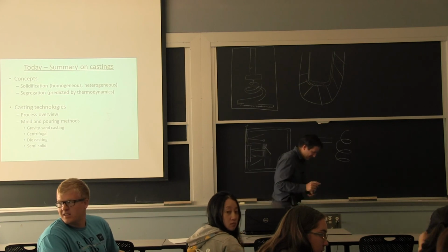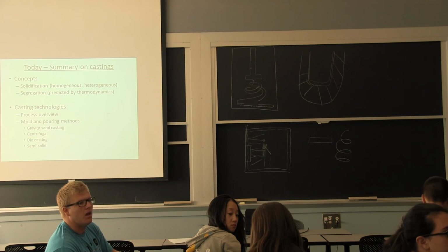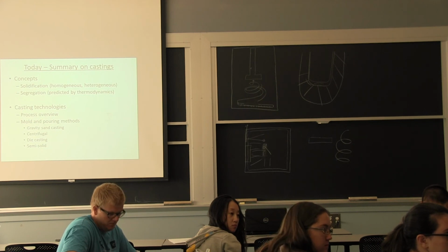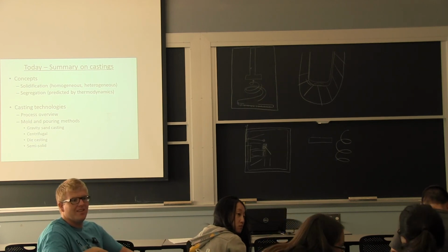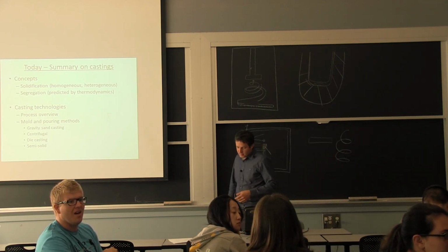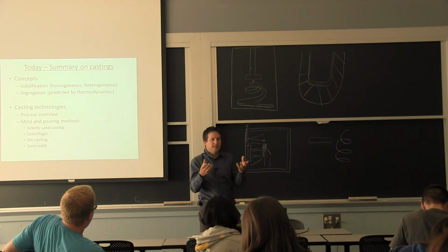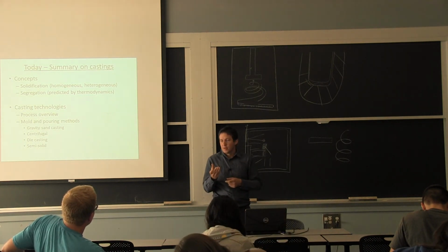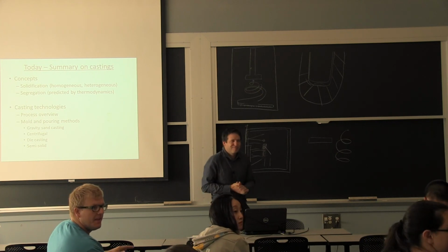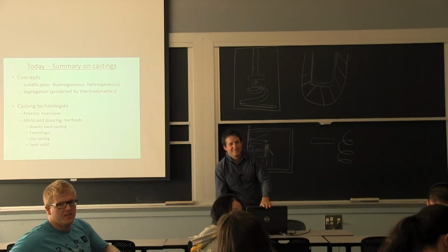It is a single crystal, obviously, and the typical single crystals they were using at this time were, I can't remember the name, a bunch of letters and then a 4 and 5 alloy, and they're typically 6% rhenium, which is a platinum group metal. So I like to keep them. You can make your pattern that you will cast these blades with holes in it for air circulation. I'll show you one of those tomorrow. Those blades are worth about $7,000 a piece, partly because they have about $1,000 worth of metal in them.